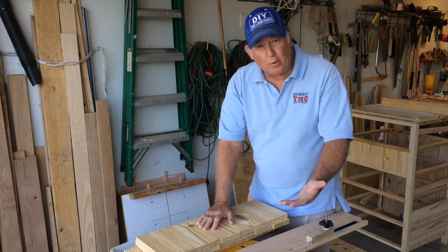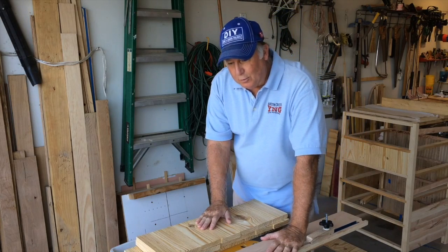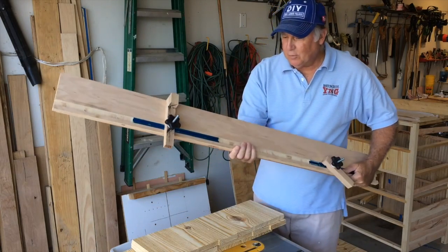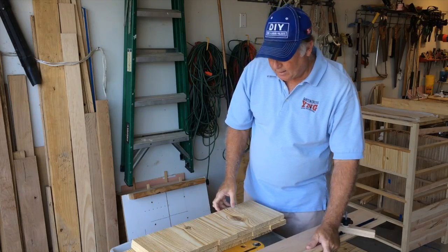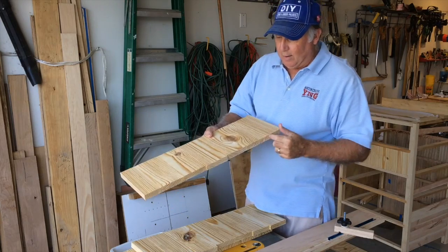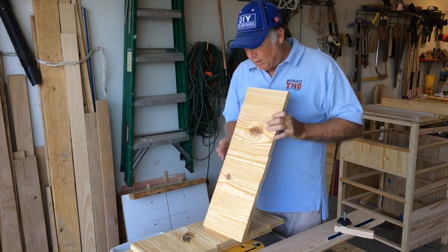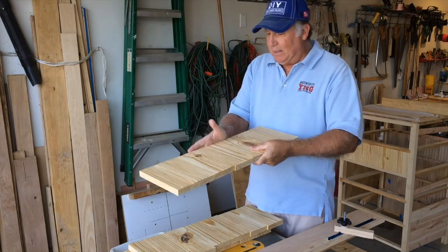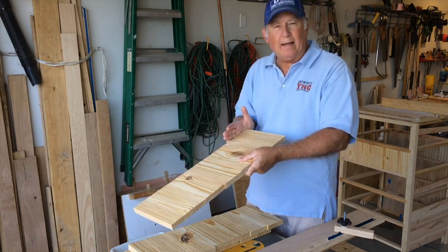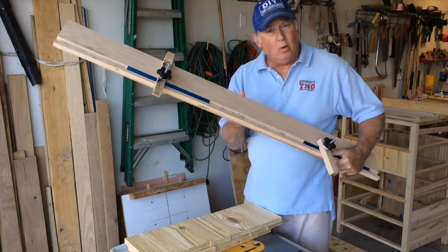Here's one thing I've learned: when you do a project for the very first time, such as building a dresser, you have to have the right jigs to make certain cuts. This one I had to build to make a straight cut on my drawer panels and back panels. When you do a glue-up and it's real long, both sides may not be parallel or even, and you can't put it against your fence and cut it — because the cut will reflect whatever ragged edge you have. To cut it square, you need one of these.